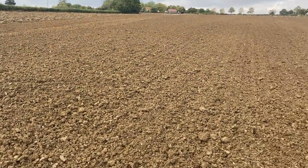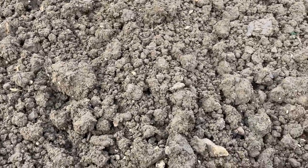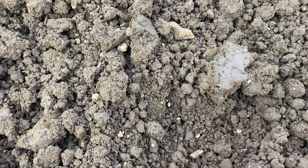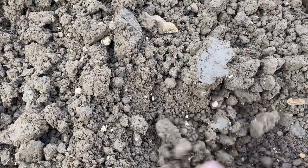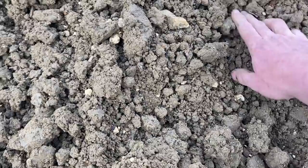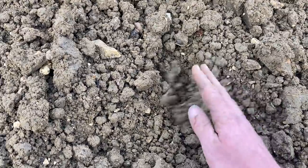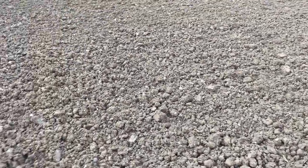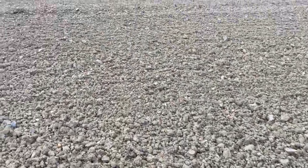While waiting, let's have a quick look at the seedbed to see where the seed is down here. It's not the greatest seedbed in the world, but there's very few sitting on the top — very little of it. There it is, down there — there's a row there, yeah. That's all about the right depth. It's your job to get the depth right on this field because the soil conditions vary so much — in some places it doesn't seem deep enough, in other places it seems too deep. At the moment I'm in the four and a half metre.